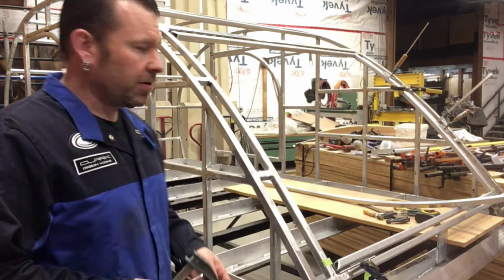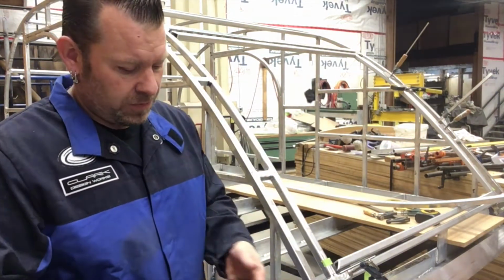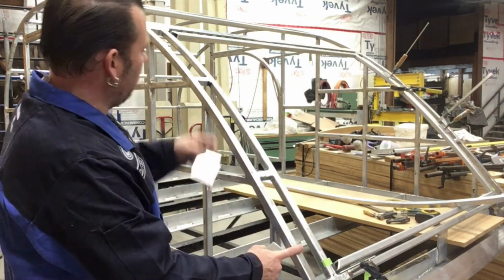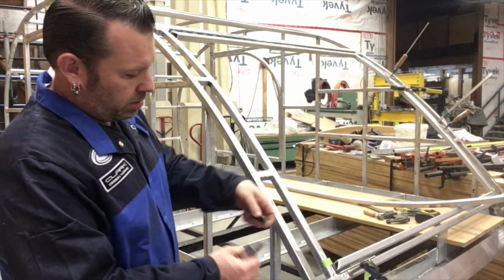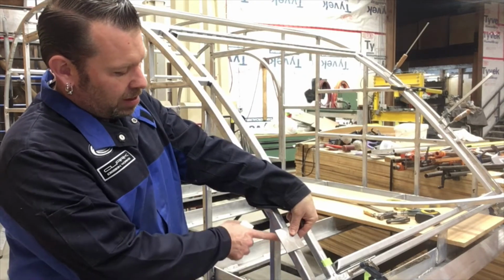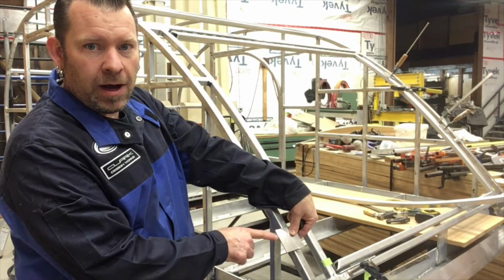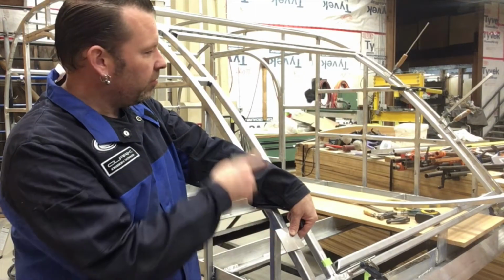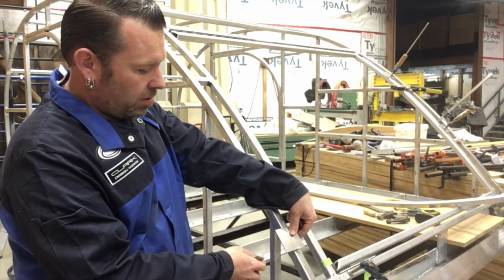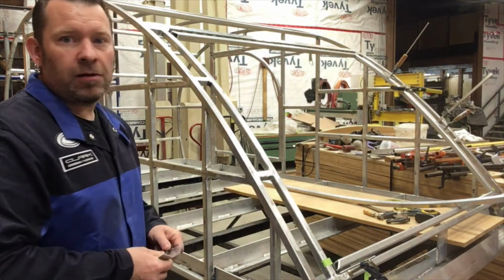All right, so the first thing I'm gonna do is take a couple pieces of metal and little quarter-inch blocks, and I'm gonna put them one here, one here, and one here, and clamp them down like this. That'll allow, when I put my side piece on, to come up to this height underneath, which will be a quarter-inch taller, which is what I need for the door. It needs to be a quarter-inch proud. So I'll put one there, and one there, and that's how I'll start.